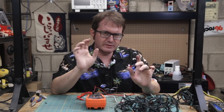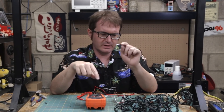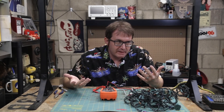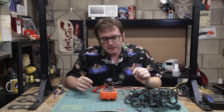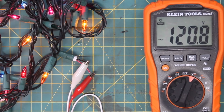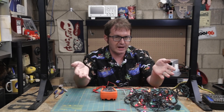I've built a little test rig — essentially one of the light plugs with bare wire put in to connect to those contacts so I can measure the voltage coming off of there. I expect it to be 120 volts, but you never know. Now, we are dealing with household current — 120 volts AC, 15 amps. Don't mess around with it if you don't know what you're doing. I am a trained professional. I have shocked myself on household current more times than I can count — it is quite unpleasant and it can stop your heart. Let me plug that in. Hold on to your butts. Lights are lit up, and 120 volts here. So now I reliably have 120 volts I can siphon off of just about any of these standard light strands.